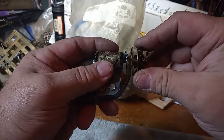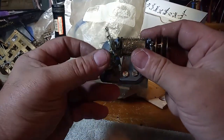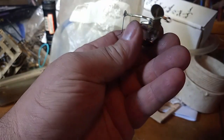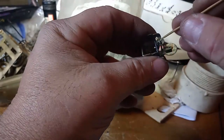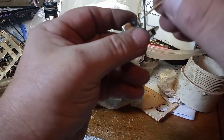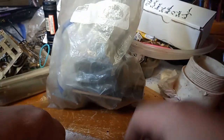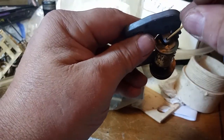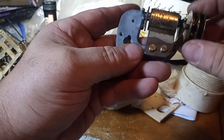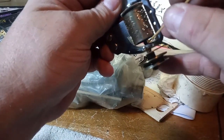So anyway, this wheel works. It's not slipping. And so it's time to put the governor back onto this assembly. I did oil the pivots just like you would in a movement. There's this pivot, this pivot, this pivot, this pivot, this top pivot here, and then this bottom pivot. I also put a drop of oil inside here for the drum. And I need to put a drop of oil right there.